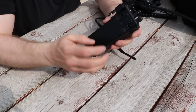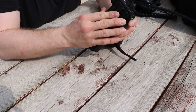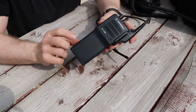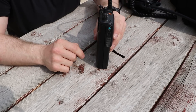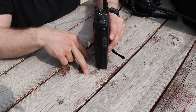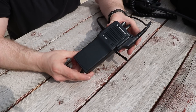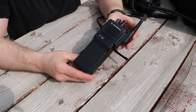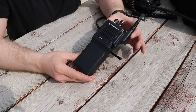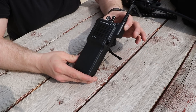This is the radio itself. The battery pack is on the back — you pull it off and put it back on, that's how you get a charge. You don't have to have the radio always docked to keep it charged. You can just charge the battery in the radio charger and have two batteries — that's how we make sure something like this stays running through a 16 or 24-hour shift. These HT1000 batteries normally get about a shift to a shift and a half in normal use.